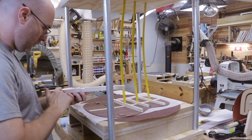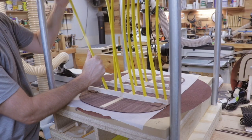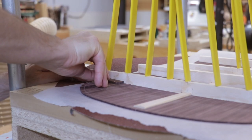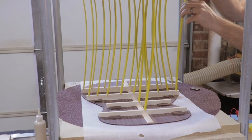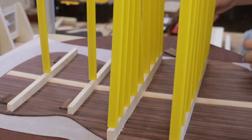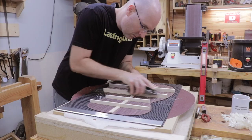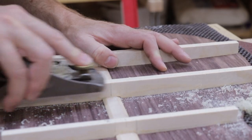I then glued the braces to the back plate using the go-bar deck and the radius dish. By gluing the braces against the radius dish, the back plate will conform to the radius dish. I then cleaned up the excess glue. Once the bracing was dry, I took them out of the go-bar deck and began work on shaping the braces